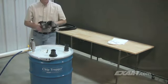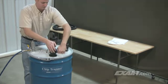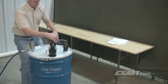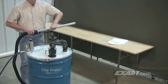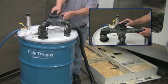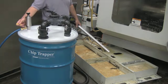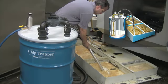The directional valve assembly with the two quick-release lever lock fittings is secured onto the drum lid. One end of the 10-foot length of chemical-resistant hose slides onto the barb fitting of the directional valve. The aluminum wand is then inserted into the other end. To vacuum the liquid, the directional flow control valve on top of the drum and the knob on the pump are set to the fill position. The air supply valve is opened and the pump immediately starts pulling in the contaminated liquid through the hose and into the drum.